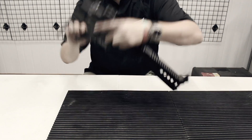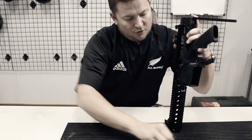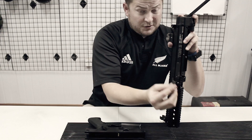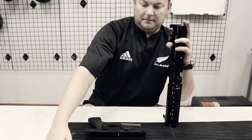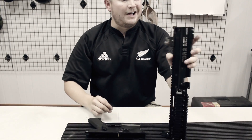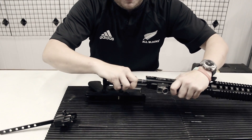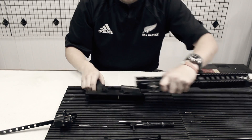Once you've done that, you've got to remove the lower, which is just two pins — one, two pins there. That comes away very easily. Next thing is the air port, which is this third pin up here — a shorter pin, so don't get that confused when you're putting the thing back together. The air port comes out like that with the spring. The last thing you need to do is remove the charging handle, which just comes out very easily with the rest of the action, just being careful not to get things stuck.